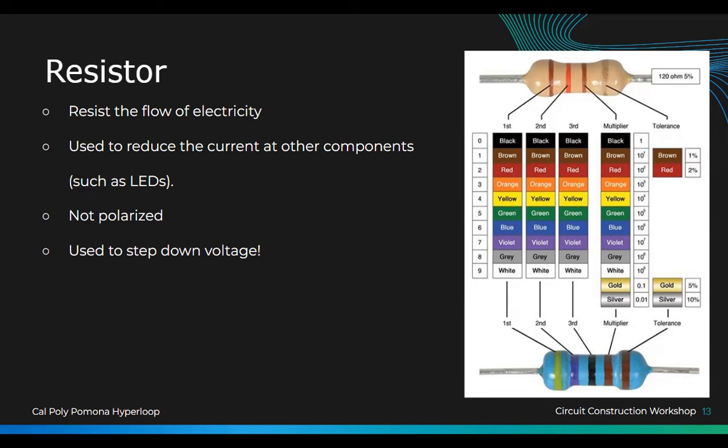Now, if you were to go to 200 mega ohm, you'll see 0.09. That's not very precise. So just use that to help you find the ballpark of what exactly you're measuring. We good?